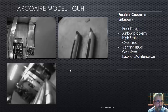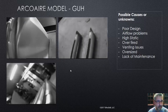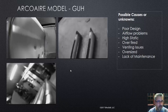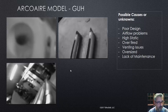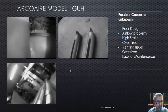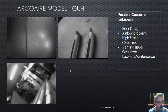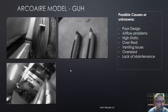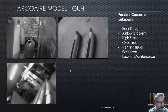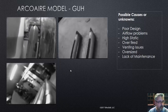When I go over to the one on the left, I cut the back of it out because once I found the problems from the top, I had to show everybody. I spent about two hours breaking these furnaces down. There are the dimples — didn't find any problems with them. That's an area where you have to watch where the primary connects to the header plate on the front. Check that and make sure you don't see corrosion, fractures, or openings. That tube was in pretty good shape considering the age of the unit.